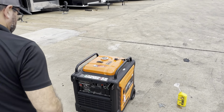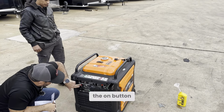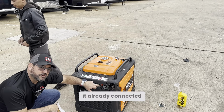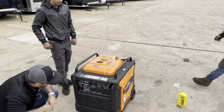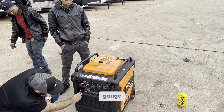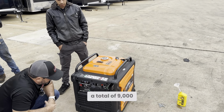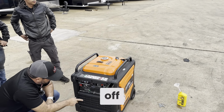All right, we're ready to start this bad boy. On the controls, you have the on button — switch it to on. You have a circuit breaker: if it's already connected, you don't want the circuit breaker on, so put it in the off position. Then turn the fuel switch all the way to the on position. This unit has 9,000 starting watts and 7,600 running watts. Turn off the low idle.